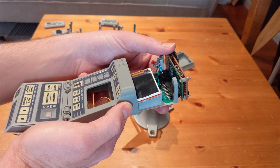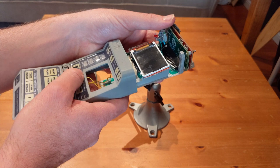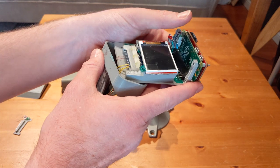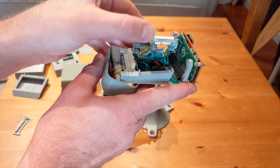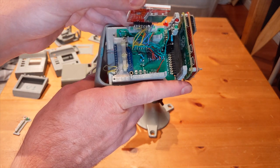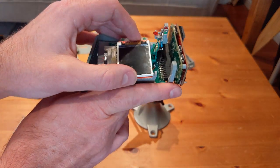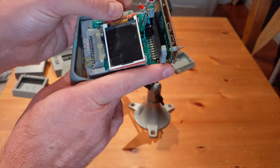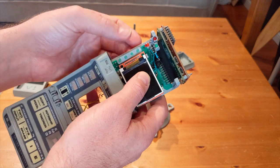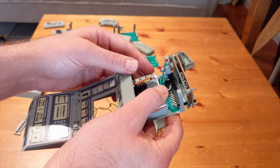And now for the big reveal of the main chassis — let's slide it out. There you go. You can see I have some wires attached for the capacitive buttons; there are only three set up right now but there will be more. The screen sits on there, just free-floating. Below that you can see all the bodging I've done, because I decided not to drive the LEDs off the Raspberry Pi itself — I'm using a shift register now.